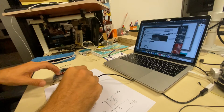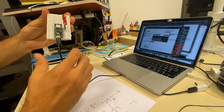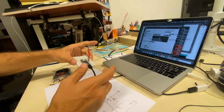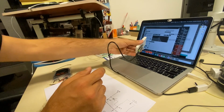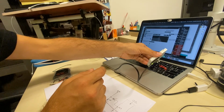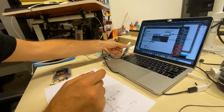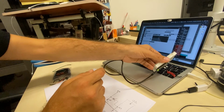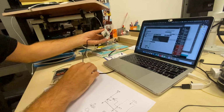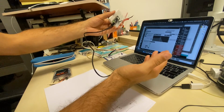So now what you will observe is a complicated phenomenon. If your cable is long, there's high chance that even getting your body close actually is already detecting a lot of noise. So then a very small source, like even random parts of my computer, wouldn't trigger it. For each place I go around, I have to let it smooth the values out. So look at the difference between me grabbing the cable or not grabbing the cable.